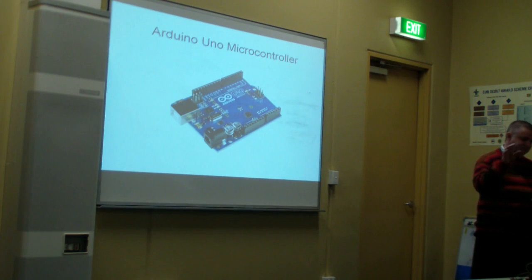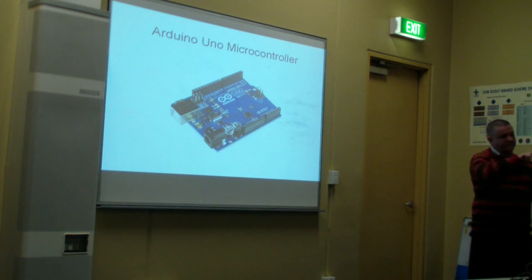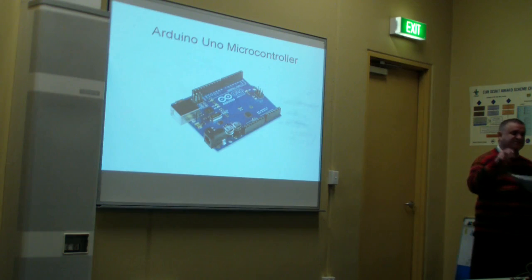Right. Now, there are also several software libraries available for the Arduino, and those libraries will strip more or less information out of the stream of information that's constantly being sent out by the GPS. They'll take those pieces of information, for example the latitude, and put it into a variable for you so that you can use that in your code quite easily.